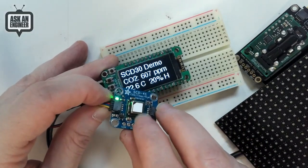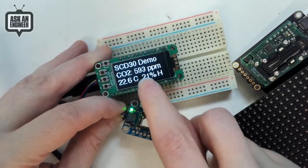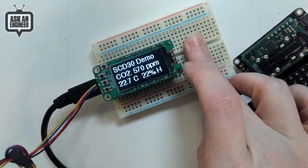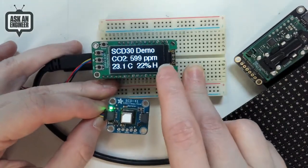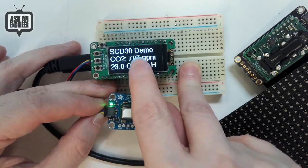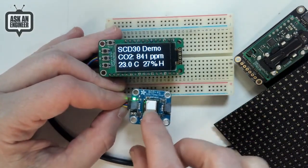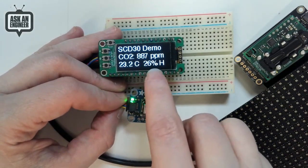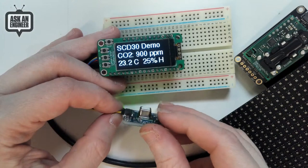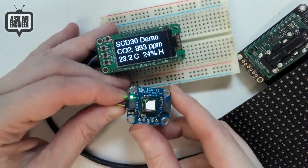You can look inside and there's a chip and the sensing element. Right now it's reading about 600 ppm, which is normal for indoors. If I breathe on it — measurements are taken about every five seconds — you'll see the CO2 slowly rise as the CO2 gets absorbed. So as you breathe on it, you have a lot of CO2 in your lungs, and over the next minute or two it will slowly drift down. It also has a built-in humidity and temperature sensor used to compensate the sensor, meaning this small package can be used for all sorts of environmental sensing projects.